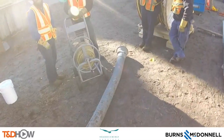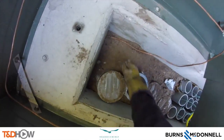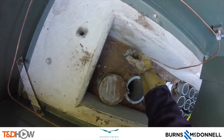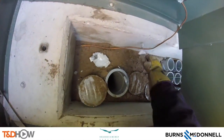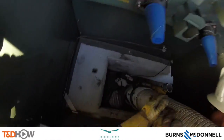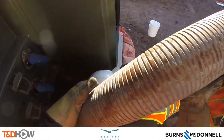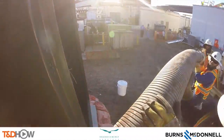There it is — and now that we've identified with the air coming through which conduit we're going to use, we can pull away the covering from that. Next we will see them set into place a snorkel — I've also heard it called a pea shooter — that will be used to protect the cable as it's pulled through this new conduit.